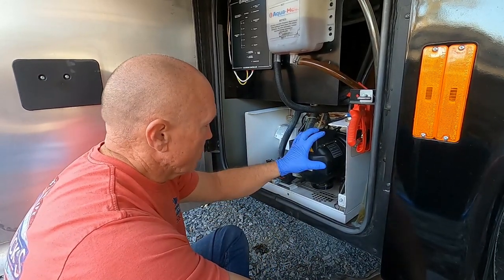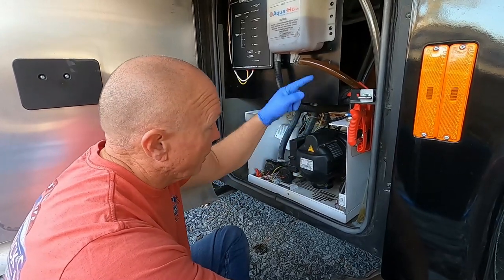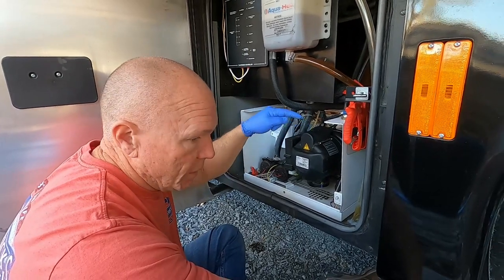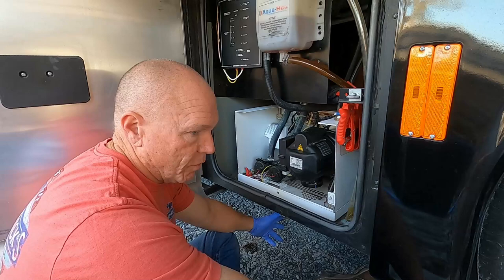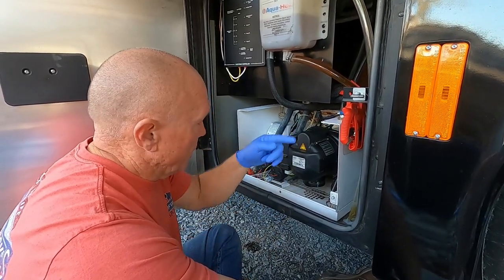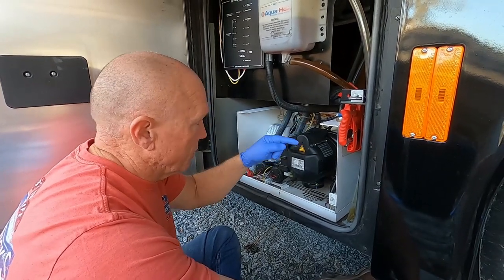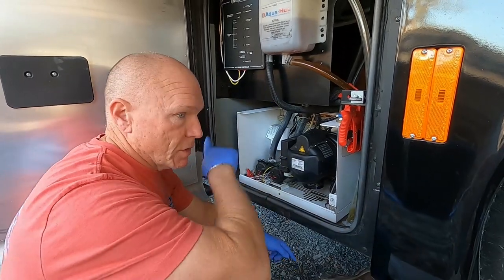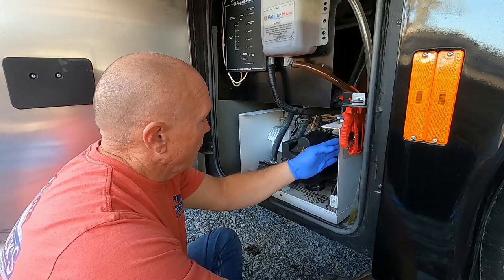This is the heart and soul — it's a diesel burner with a motor, a fan, a fuel pump, a fuel regulator — which I think is bad on ours — an ignition coil, and the fuel nozzle that sprays out the fuel. When the ignition coil ignites it, the flame goes into the burning chamber. The diesel lines come in from the tank, go through a filter, and into the fuel pump. The fuel pump is set at 145 PSI — whatever's not used immediately flows right back out in a continuous loop.